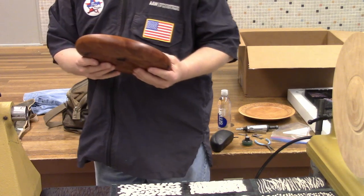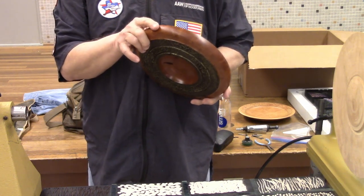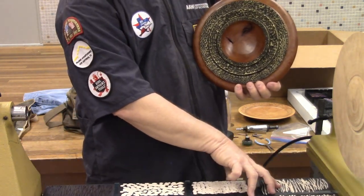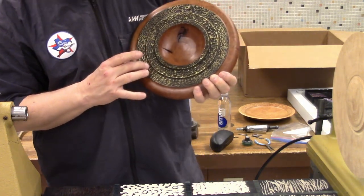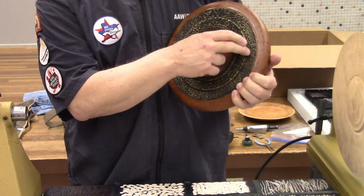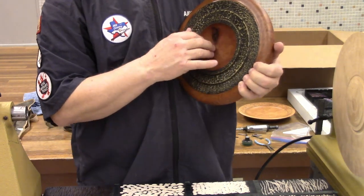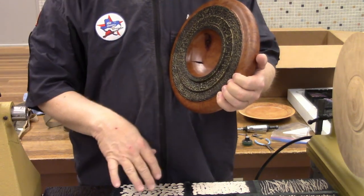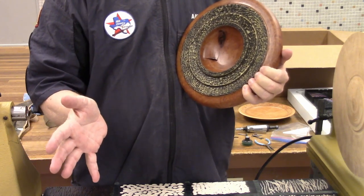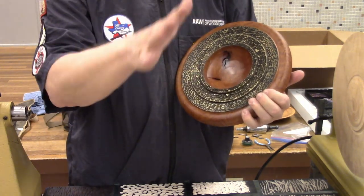Matter of fact, you want to see the end product of what that does. My buddy from Virginia came to visit, and I had a piece of Madrone burl. And he loves gnarly wood. And so that's basic. This chisel technique is what he basically did around here, all the way around. And so this is where we're going to, is creating a depression or a carving, then we're going to give it a backdrop. And I just brought black today. It doesn't have to be black. It can be any color you want to do. And you've seen the dye manufacturers, they're all across the rainbow. You pick what you like. If you're in the business, you pick what you think will sell, hence the turquoise. And then he covered it with a gilt cream, just highlighting the high points.